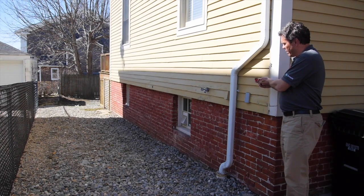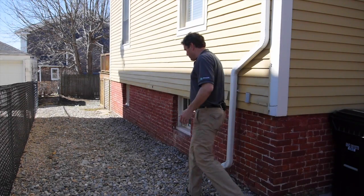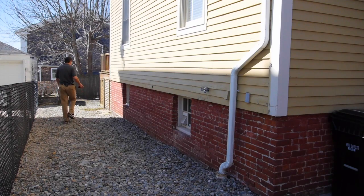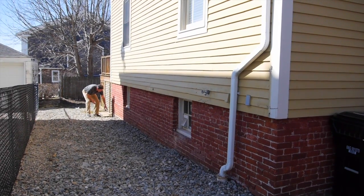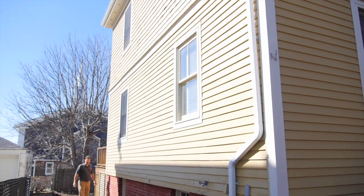I'll come out a little ways, and in smart horizontal mode, I'm going to tilt down and hit that concrete slab at the end of the driveway. I checked it out earlier — in this case I don't have any grass or shrubs in the way, so I know I can shoot from here and hit that solid target that lines up with the corner of the house. Now if I had an obstruction and couldn't hit the ground, I could use the soffit as a target as well.